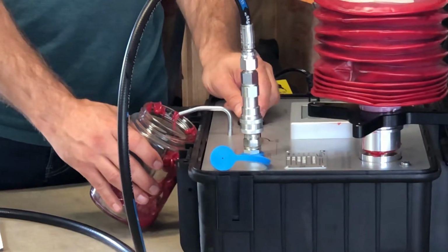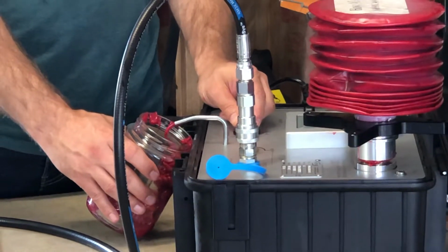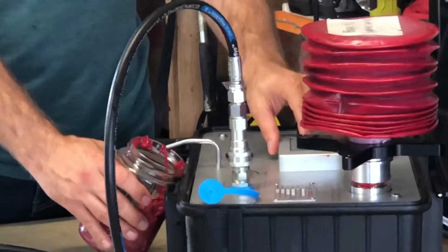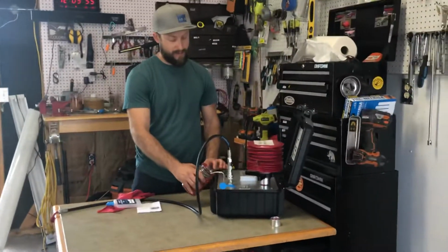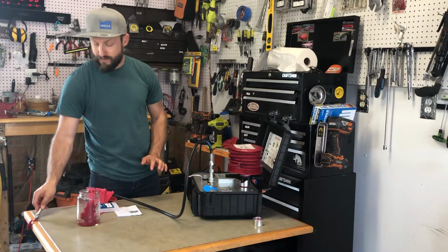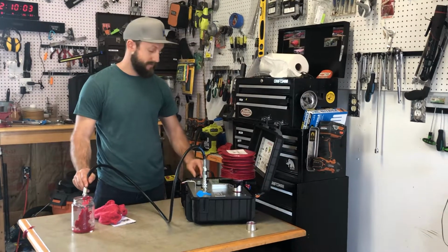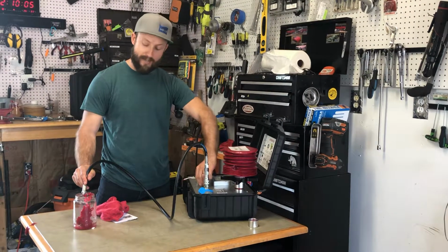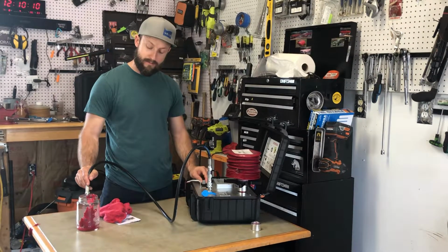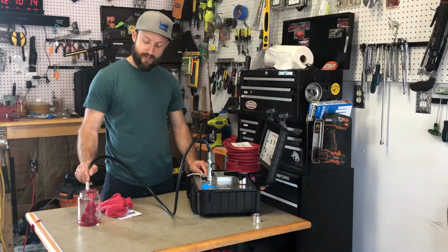And when you see that priming oil come out and the air, and then it's fresh grease that's moving well, you can click stop. And at this point, the pump has been primed and the air and old grease has been moved out. You're going to switch your dial back to pump and click start again. And you should have fresh grease pumping through your hose.